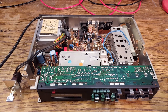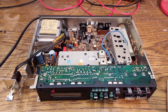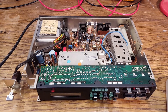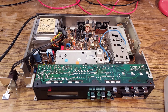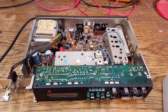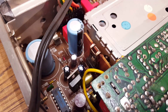I'm currently working on this 1980s Grundig T20 hi-fi tuner. It's an FM-only model — it does not receive AM, which is kind of interesting. It did need some work: it needed a good cleaning, and it needed several solder joints redone, especially those two three-terminal voltage regulators. Those were about ready to fall out. It was that bad.